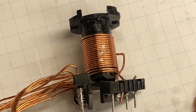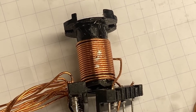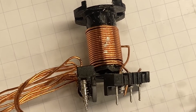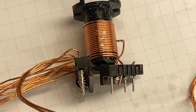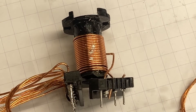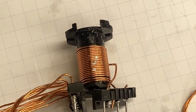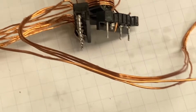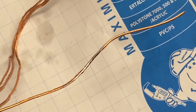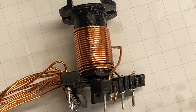Having a look at the copper wire used to wind this transformer - if you actually scrape it with a knife you can tell it's not copper, it's actually silver, meaning this is aluminium, which is unfortunate. I didn't think that was the case when I was unwinding it because it felt very soft and very light. It looks copper because they electroplate it in copper, but that's only to help solder adhere to the windings themselves. Being aluminium it will have a higher resistance, which means the transformer will put out more heat and it will be less efficient. You can see there's more aluminium there underneath that copper colour - it's got a very silver grey look to it. The quality of the transformer is not that great and the insulation is marginal at best.